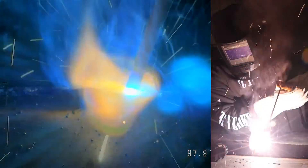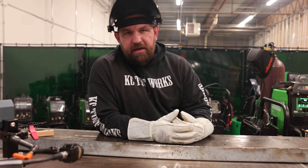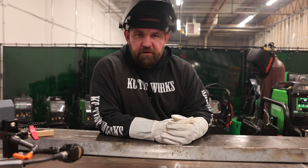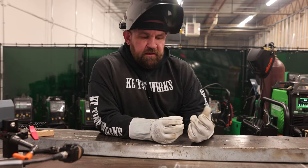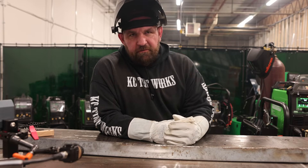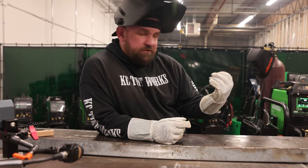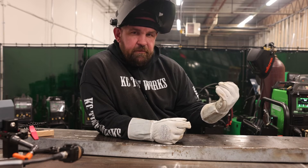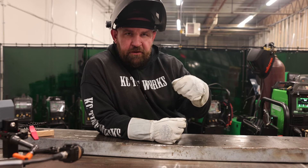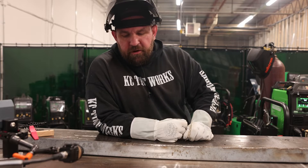We do have a pretty cool feature on here where you can actually run the remote. If you were doing some really bad fit-up stuff — I used to do some stick welding on dump trucks, repairing frames that were cracked, and sometimes you'd get some pretty big gaps or large voids to fill — something like this next feature would be pretty cool. We're going to turn on the remote setting so we can actually use a foot pedal, strike an arc, and then control our amperage with the foot pedal. Let's get that set up real quick and we'll run another bead.